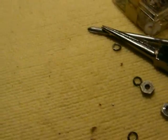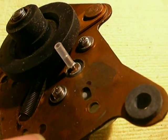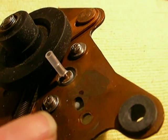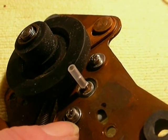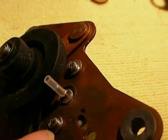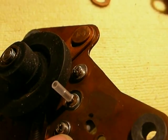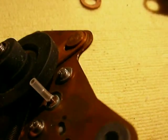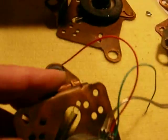That will give you a motor eventually mounted just like this. I gave you four washers with the two special metric screws. Put two washers under the head of each screw — two washers under this screw and two washers under this screw. That's necessary because the screws are too long and they'll bottom out in the motor, and you'll strip them if you try to over-tighten them.